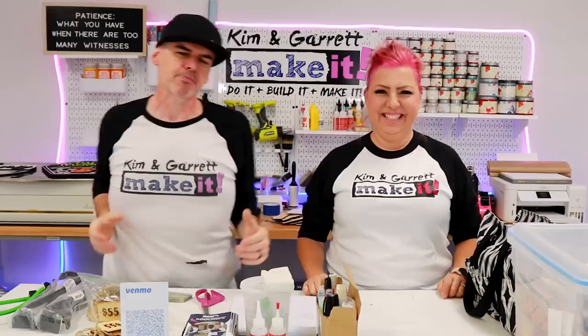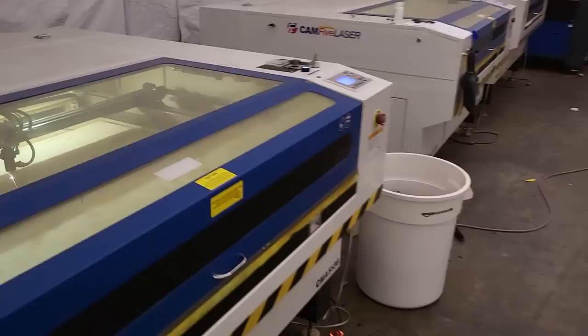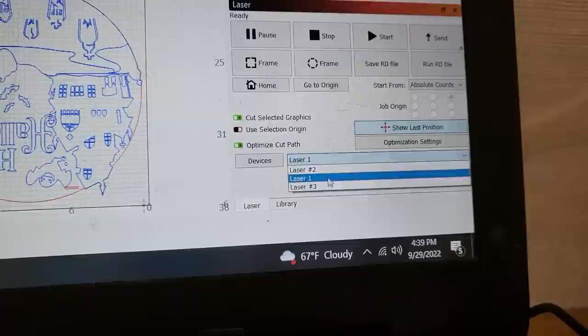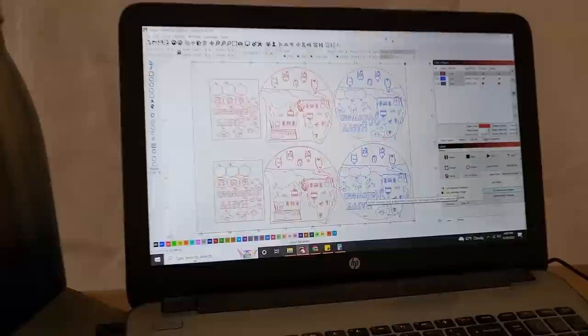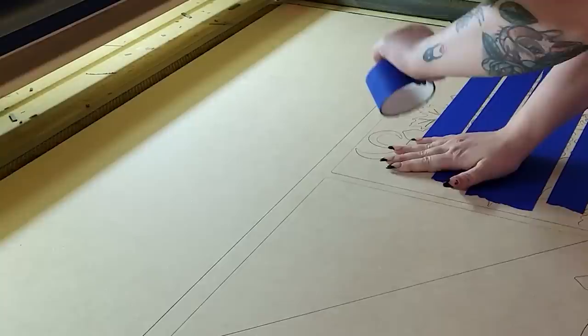Step three: we're going to make all of our cuts, but we do these in batches. We can fit six signs at a time in all three of our big lasers, so I like to run six of the same sign at the same time, all kicked off at once. If you're using Lightburn, did you know you can put your lasers on the network and find them by IP address and send your files over the internet that way? One laptop can run all three lasers — that's really handy. I can frame it on each at the same time, watch them all get framed out, start them all, and they'll all be done at about the same time. Then I tape everything off so all the little pieces stay together and we bring it inside.